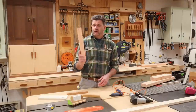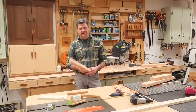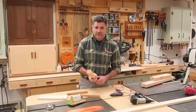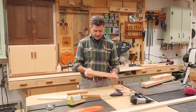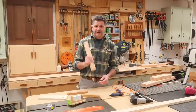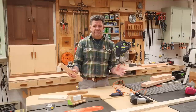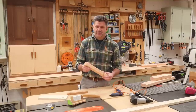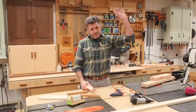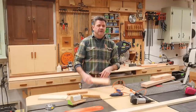So that was just one of the parts to the shed transformation project I'm working on this week. I think it's really smart to make a jig any time you have to make repetitive cuts like that, even when it's framing — because your framing is so important. When it comes time to do the trim work and the sheetrock, if your framing is out of square, not level, or out of plumb, it's going to make all the other work way more difficult. In this case, I'm going to have a nice flat ceiling to add my first board, where my electrical will come through for the track lighting.